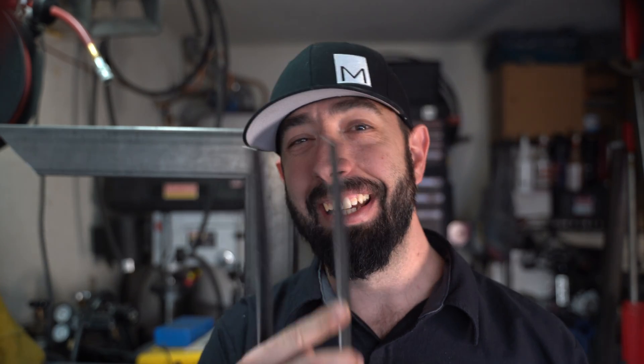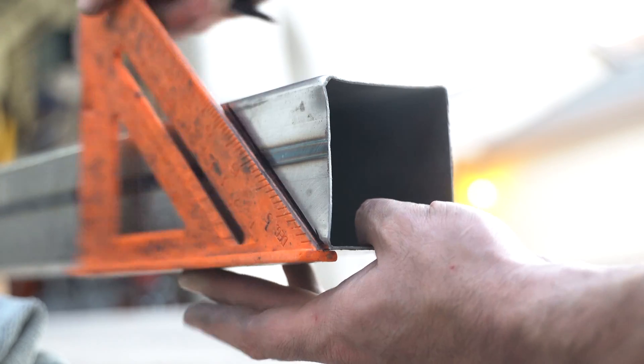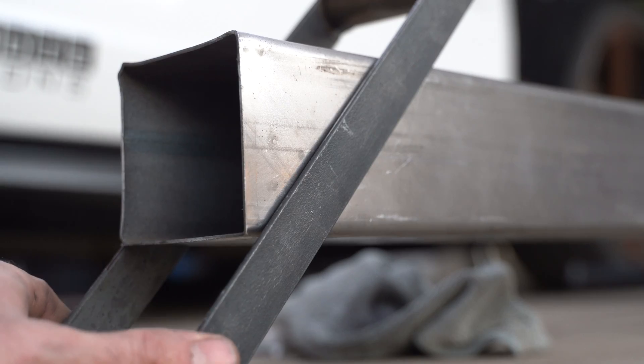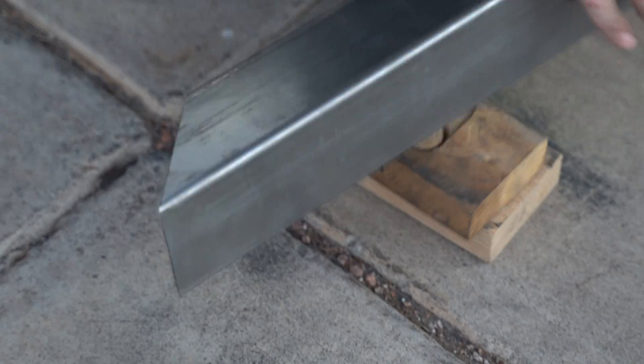And that's where this thingy comes in. It looks complicated, I know, but this modern marvel will make life much easier. I've made one for every size tube I've used, and I reach for it for every frame notch I build, or anything that requires a miter joint. To use it, determine what angle you want — in this case, just an easy 45 degrees. Line up the tool on the mark you just made and scribe the opposite side. Done. You now have two marks at identical angles, precisely opposite one another. The rest just depends on your ability to cut on a line.